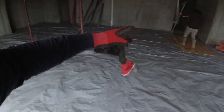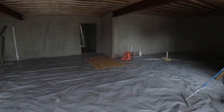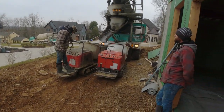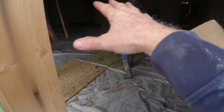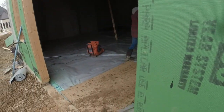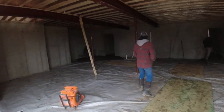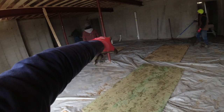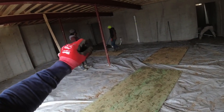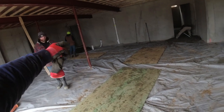We'll do zip strips corner to corner, down the center, probably one down the center of that room behind that wall. Just looking through everything, making sure it's in its place. We're on truck number two; number three is here on deck mixing up right now. We have a drain right up there in front of Steve — that's the only drain in here, for the utility room. We give that about a half inch of fall, just a little bit in case the water tank or condensation goes in there rather than running across the floor.